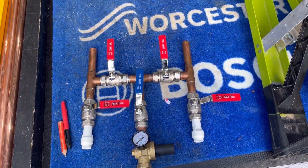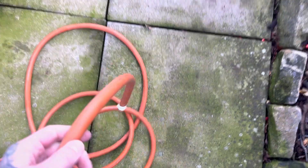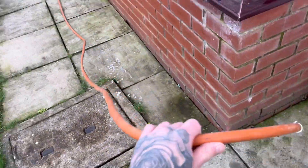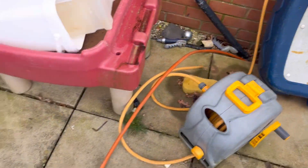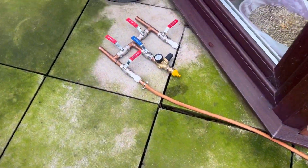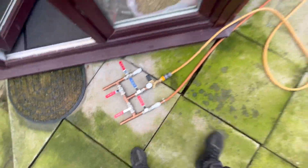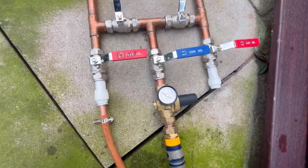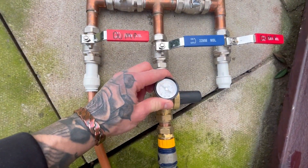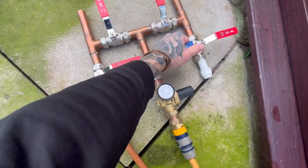Let's get it connected. I'm going to use the orange drain-down hoses for the dump side. Although these shouldn't be used for mains pressure, they're not going to be — they'll always have an open end so technically it's not going to be allowed to build up to mains pressure. That's going to go into a drain. I'm going to connect the hose pipe onto the cold mains in. You have a standing pressure of just over three bar — this might be set at three and a half — I need to reduce it down. That's a decent pressure coming in.